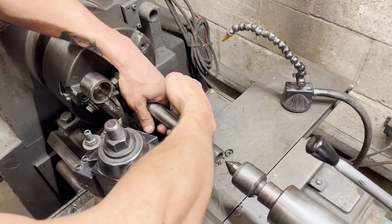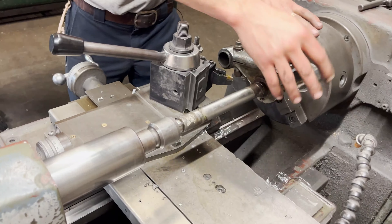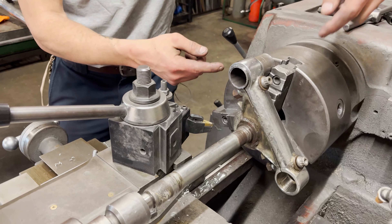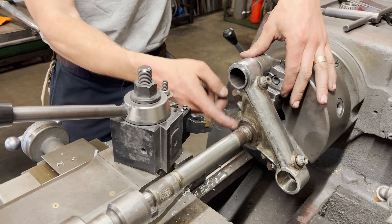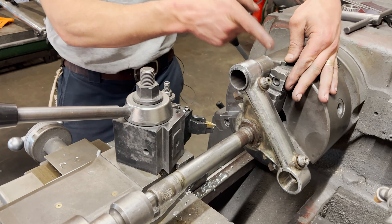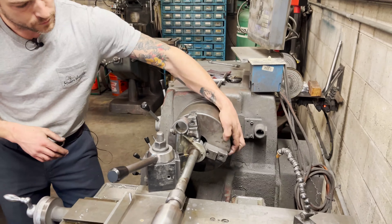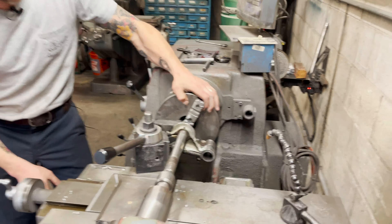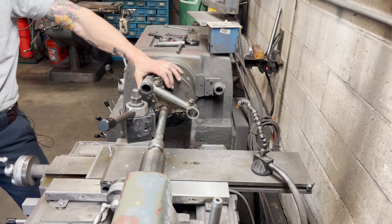The way I'm going to do that is just lock in against the dead center, tighten the tailstock directly against the front of this, and lock all that in. Now the only thing keeping this from moving is the chuck jaw, so once that's locked against the chuck jaw we're good — the forces applied by cutting will be applied right into that jaw. I also rotated the tool holder to make sure we have enough clearance between the top of the tree and the edge of the tool. We've got safety glasses on — just did a dry run, everything clears, rotates fine. We should be able to get all the way into that corner with the tool. It's close, but she clears.